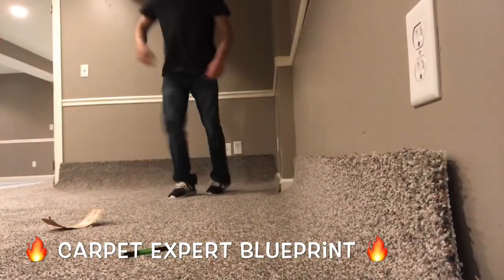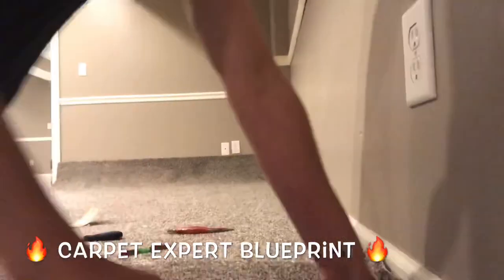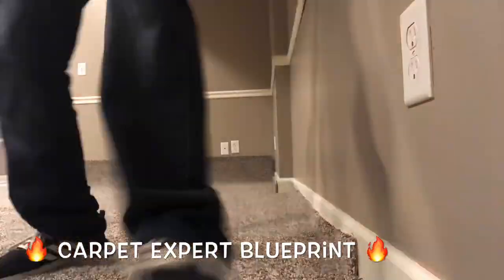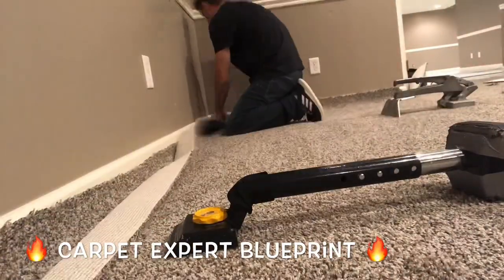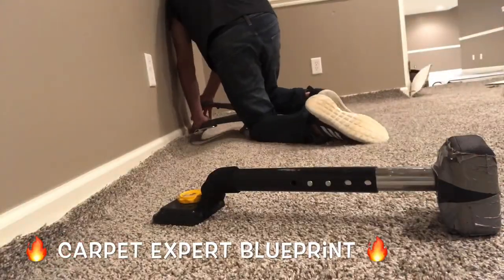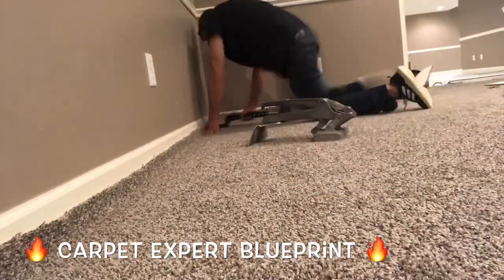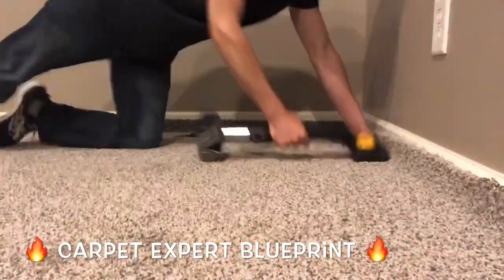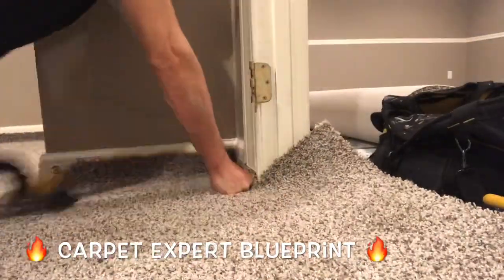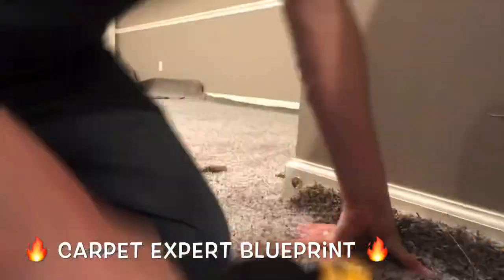So now that the seam's burned, we let it dry for a good 10 minutes or so. We're going to rough cut everything in, lock on our set walls, go ahead and trim and tuck them. Then we're going to bust out the crab stretcher and go to town. Why are we using the crab stretcher? It's a big open room — you want to make sure everything's pulled tight. It's not kicking on a little 10 by 10 room where you can just blast it on and be good to go. You want to make sure everything's nice and tight so it doesn't buckle down the road, especially during these cold months.